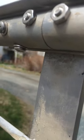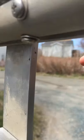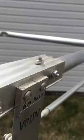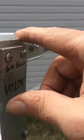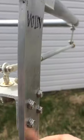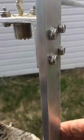Where they meet here in the middle, I have sleeved it inside with a piece of pipe that just fits inside here — a piece of electrical conduit that just fits inside this tubing. The angle I put on there was formerly the armrest on the lawn chair, and I incorporated that into it as well. I used a piece of quarter strap aluminum for the mount.